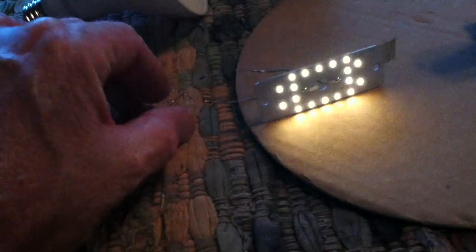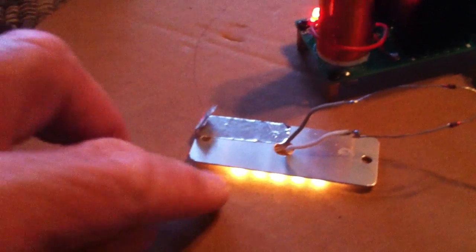And then you've got this brilliant light. If I take this and put it over here and just set it in there, this thing goes nuts. This would be a pretty neat little light, except for the fact it's drawing 12 volts at about 200–300 milliamps — it's a lot of draw on this particular Slayer Exciter. But that board is really cool, and it does what we've been looking for, where you can feed it from the back plate and let the AV plug just hang out in space and get it to light up.